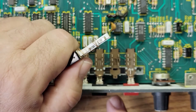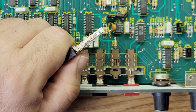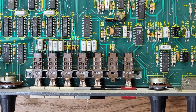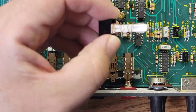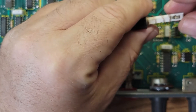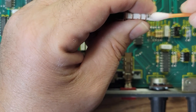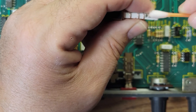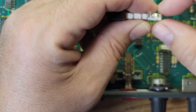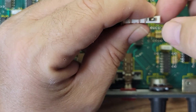We're gonna clean the switch — stick a q-tip in there and clean the sides where it makes contact too. I'm just gonna use a little isopropyl alcohol to clean it. It doesn't look that dirty. See how it comes out — that's where you get into trouble, you can lose the spring easily.